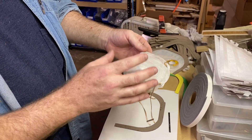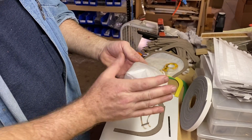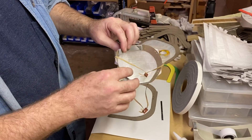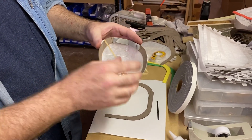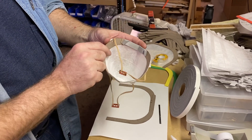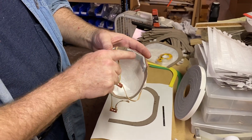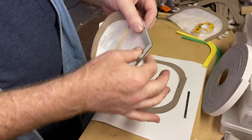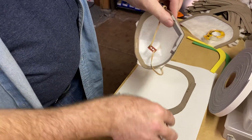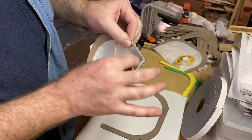I do not know to what extent — we're still researching that. Obviously, the better filter material you use, the better off you're going to be. This is 1900, it was locally sourced and available, and that's what we've used at least at this point for this prototype. The frame is made out of cardboard, which is also easily locally sourced. This strip right here both cushions the nose and hides a metal strip used to keep the form of the nose — that's made from a window seal, just ordinary self-stick foam window seal.